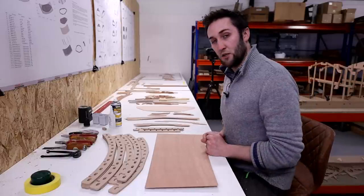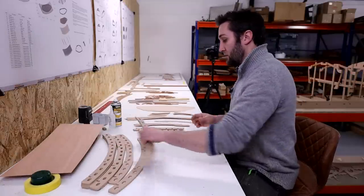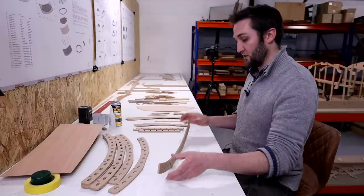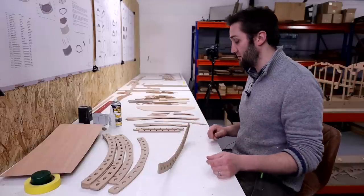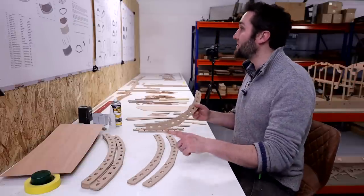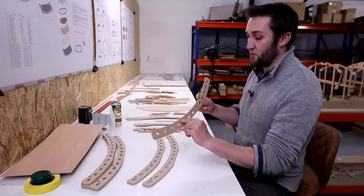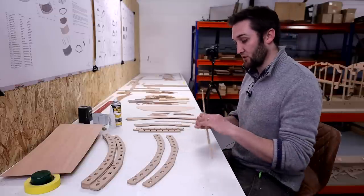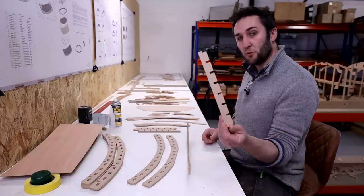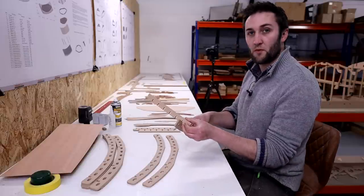With the curvature of a transom it's a little bit more tricky. So let's get working on the jig. The transom is made in this jig system — like a little cradle basically — which is going to help us spring in the curvature of all the various parts. That's all part of the CNC cut jigs file. You can see we've got these transom mold forms which give the curvature, and they've got a little cutout for a half-housing joint so everything just slots together. Then we've got a transom mold joiner that fits into that half-housing joint and slots together like that.